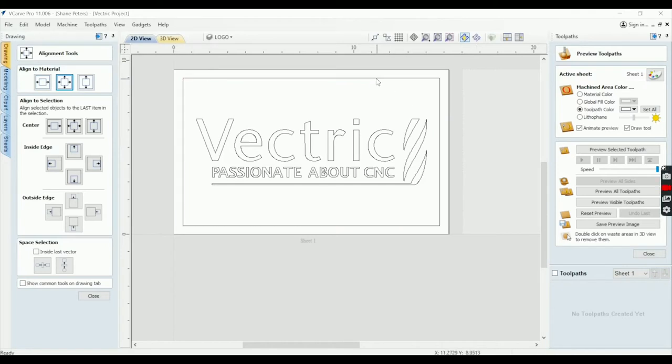And now you can see if we cut this pocket first, we'll be able to fill that void with one color epoxy. Then we come back into the cured epoxy and cut this logo and pour that with whatever color we need to do there. And that is pretty much the gist of it.